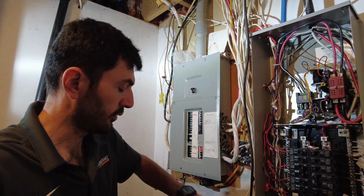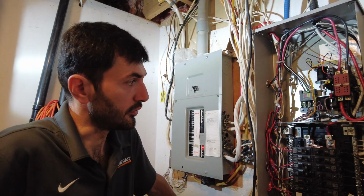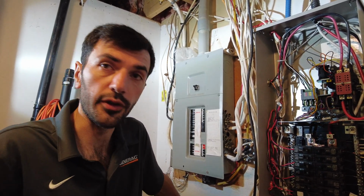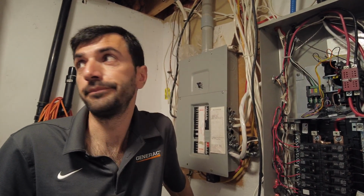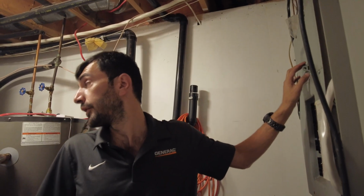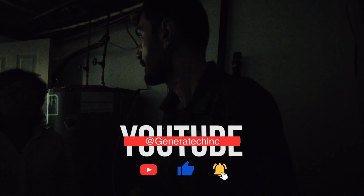It's about 2 o'clock now, so it took us 4 hours to do this job so far. One more hour to do the test, answer the questions of the customer, do the Wi-Fi connection, and we're good to go. I'm gonna turn off the power for the whole house. Between 5 to 30 seconds the generator is going to start. I guess this model is 5 seconds. So after 5 seconds it starts, and you're going to hear a click and a spark. In here it's going to give the power to the house.